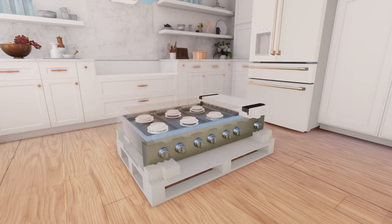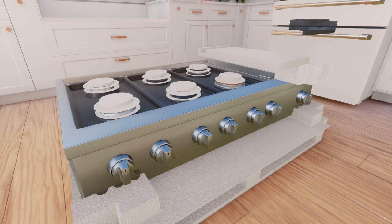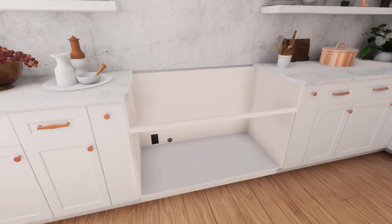Remove the grill or griddle covers, grill grate, and burner grates. Then, lift out the cast iron griddle flue cover, grease troughs, and pads. And cut the ties holding the grill grate to the grill frame. After removing the ties, lift off the burner caps and remove the underneath foam pad. And then lift off the burner heads and remove the underneath foam pad. Repeat for other burners.